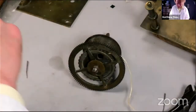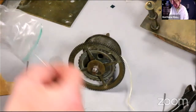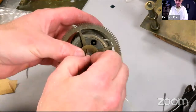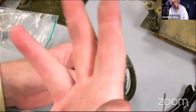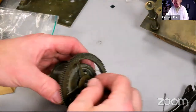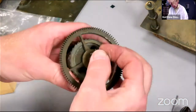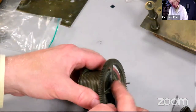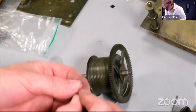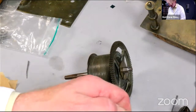Oh, so many super top tips I'm going to tell you about tonight. When you put this pin in to hold the slip washer on, don't cut it off flush, for the same reason we've got with the top block of the suspension. Otherwise, the next person finds it nearly impossible to get it out. And also, it mustn't go up the whole way through. Again, sort of threw that file away rather nonchalantly. Draw file.